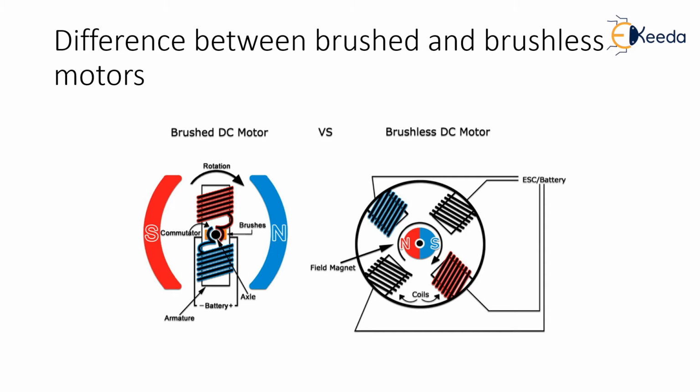The size of a brushed motor can be identified through a simpler two-number system that clearly defines the diameter and the height of the exterior in millimeters. For example, 6 cross 15. The first number 6 is a measurement of the can's diameter, and the 15 is the height of the can.